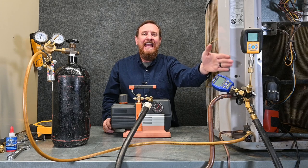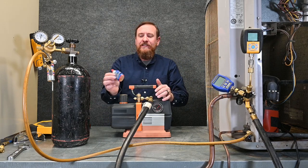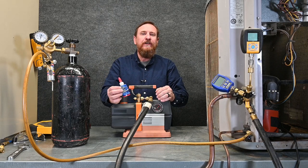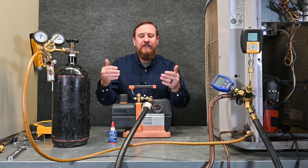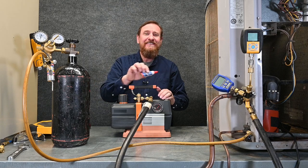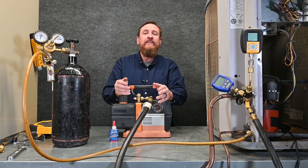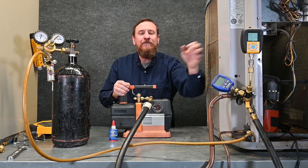I personally really am a big fan of using some kind of vacuum-rated valve. Some people get very nervous about having more fittings, since more fittings mean more chances for leaks — and that is essentially true. That's why I'm using this product called Nylog. I have no connection with Nylog whatsoever — I learned about it from Brian Orr, started using it, and it really made a difference. When I put this on a connection, it helps it seal. It's made of refrigerant oil — the blue one is used for POE oil and the red one for mineral oil. It makes a nice soft seal on the outside connections, so it's not going to be getting into the piping. Even if it was, it's not going to flow with the vacuum and won't cause any contamination in the system. So even though I have all these extra connections, this product helps make them so they don't leak.